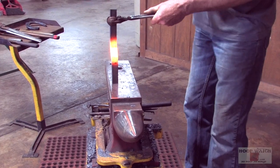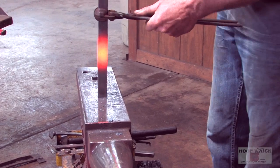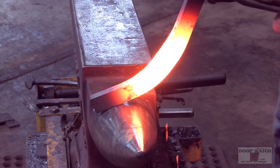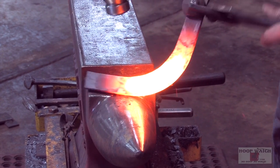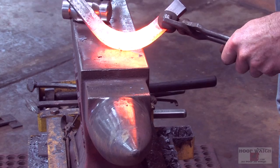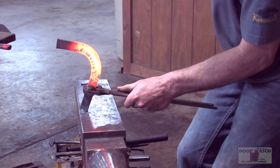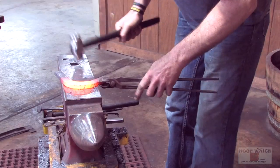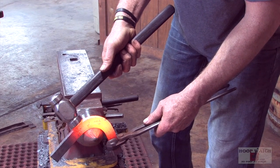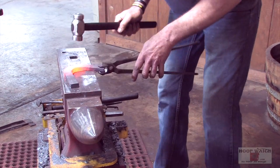Just going to put some material into the toe. Conserve your energy — you've still got another toe to bump, so don't go crazy on the first one. I got just about an inch in there. Focus my toe bend around that center punch mark, obviously. If I make my bend past 90, then I can come here and pull the toe tight. What that does is it doesn't put any pinch marks here, and I have a nice transition coming out of my toe since it's feather fullered. I got a nice even toe bend.